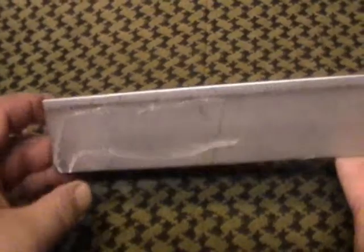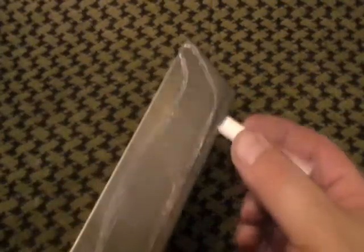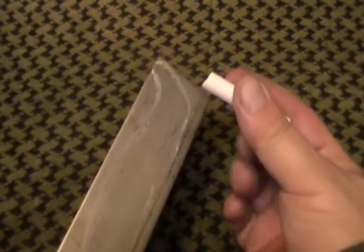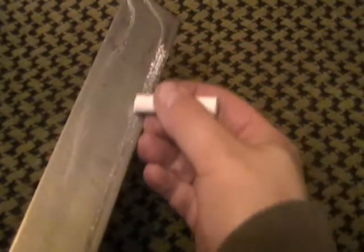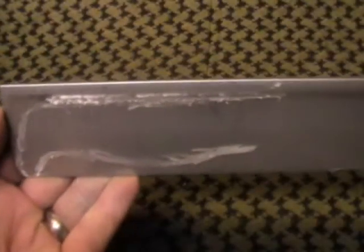Okay, so I've got something to stop my finger flying off the end. Now one little tip I use for drawing a parallel line is actually try and turn my hand into a marking gauge. So I set my two fingers holding chalk and the middle finger there. The middle finger goes up against the metal, they're holding chalk or a pencil. I go like this and literally just go ready, steady. Like a marking gauge. So I've set the distance and just draw it up, keep my hand in that position locked, and just glide my fingers up the edge of the metal. So I've done a very straight line, and then if I'm clever, I can do that with my finger and erase the chalk I don't want. So that's the top of my handle. I could fiddle with this later, but you can see what I'm doing.